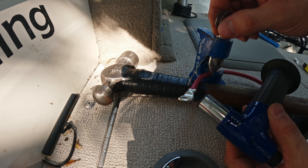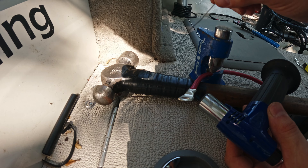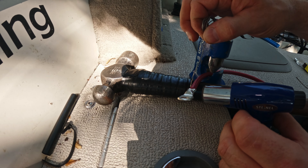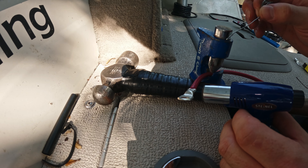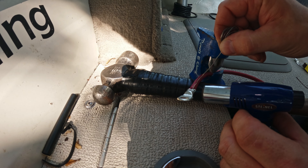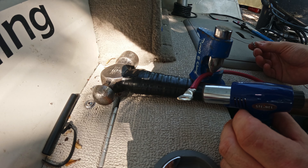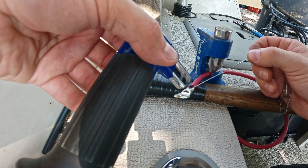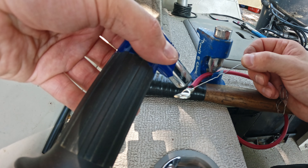Because the eyelet is heavier than the wire, that's going to transfer the heat into the wire. And then once I can melt a little dab of solder on this — once that solder melts in, I know that I can solder my wire. There we go, some solder up in there — and now it's melted nicely into the wire.